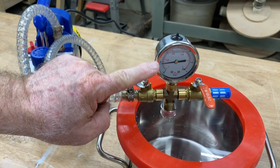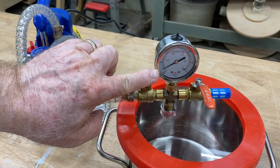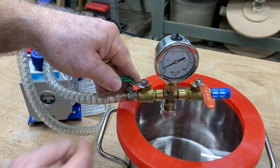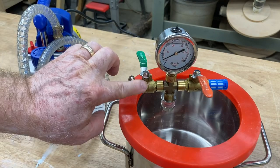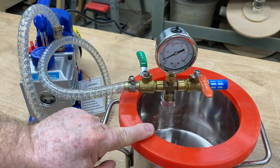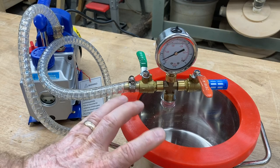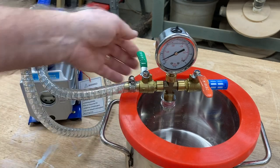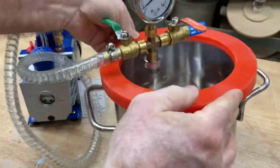Usually about 25 inches is plenty. I stopped it at 28 and a half. At this point, I can close this valve. This vacuum will stay right there, and you can successfully get the air out of that silicone or really whatever you need to have in this pot. This is very, very solid. It's not coming loose.